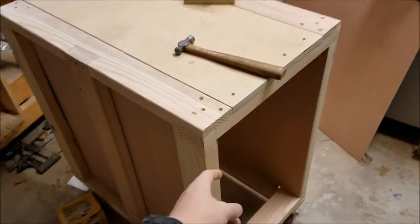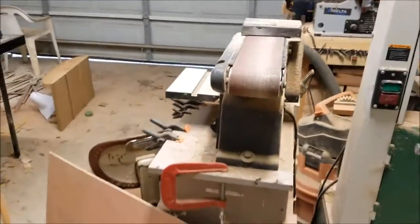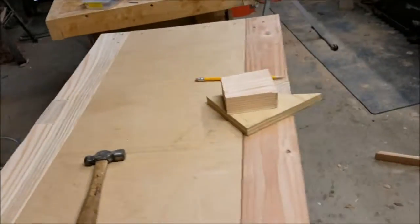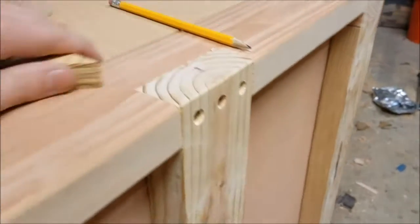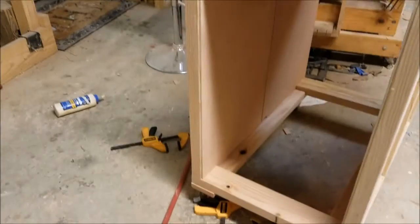In this video, I'm going to show you how to build this stand that I just built for my sander, and one that's going to be coming soon. It's 32 inches long, composed of these great looking box joints for the two squares, and these pieces with a half lap all the way down with a notch for a 2x4 to connect them. I used 1-1/8 inch plywood. Now let's get on to the video.